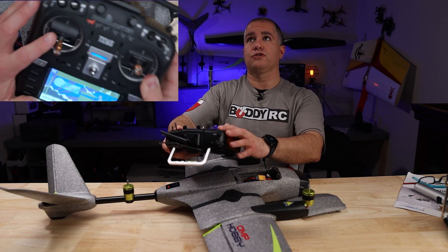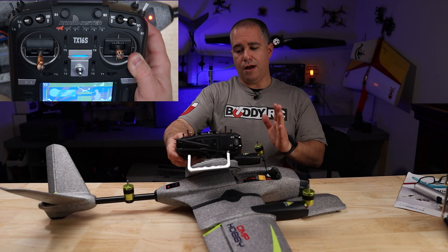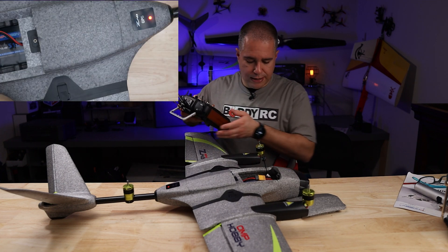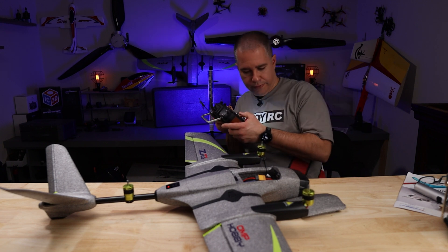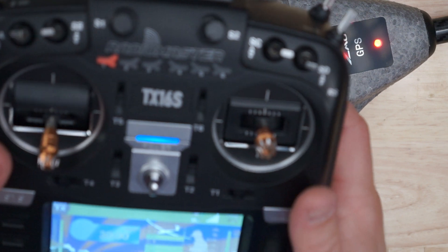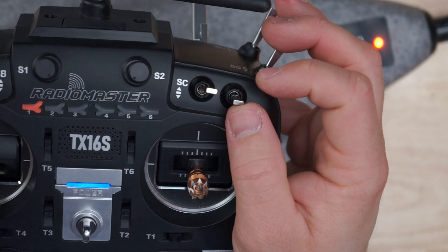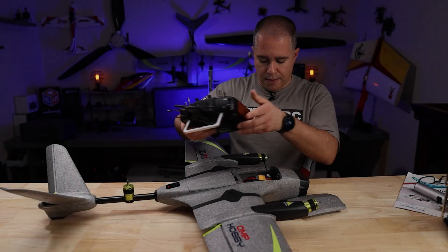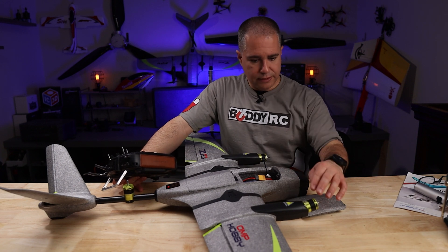On the left side, you're going to use the left stick — hit towards your left and it tilts the motor up, and towards the right it tilts it down. Right now you can see I'm tilting it down. We're going to go to 90 degrees so it's even with the right side. Then on the overhead again, you're going to go away from you, down again, and center. Now the motor pods are in the forward flight position.